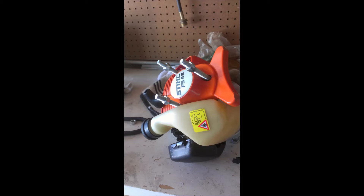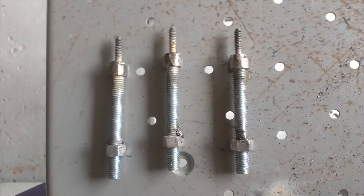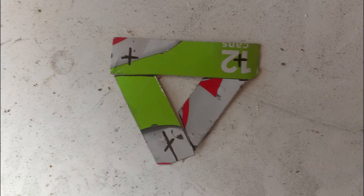All the various types and styles of string trimmers out there all have bolts that go back to the engine. If you find those, take them off and either use the same bolt or find a new one with matching thread. Get a little all-thread and weld it on the back — that's going to be a very strong attachment point.